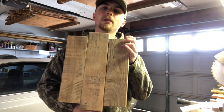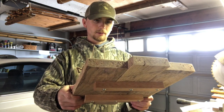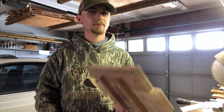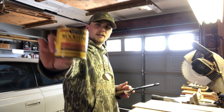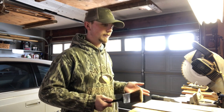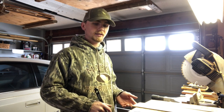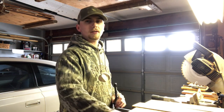Here's the finished product — doesn't look too shabby. Now we're going to stain it. You don't have to sand or stain it; some people like the rough look and I've had people ask me to just screw it together, which is a lot easier, but this looks more professional. For stain, we've got some golden oak — buy that from Walmart. Just slap it on there; you don't have to be real careful because stain spreads real easy. Let it sit for five to fifteen minutes to your desired color, then wipe it off.